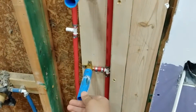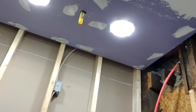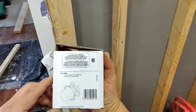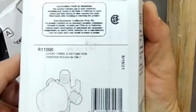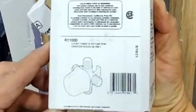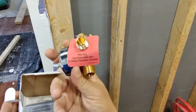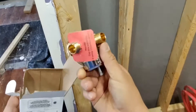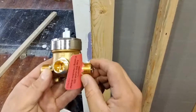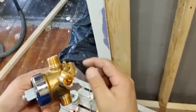The jets will be positioned at roughly waistline, chest, and neck height, connecting all the way to the diverter valve. Here's the reference valve — this one is from Delta, called the R11000, which is a sort of universal valve. What you buy separately is the trim, so this body comes by itself and then you order the other parts depending on your preference.